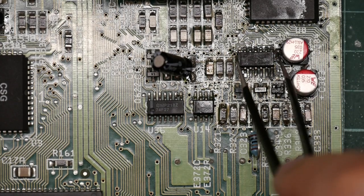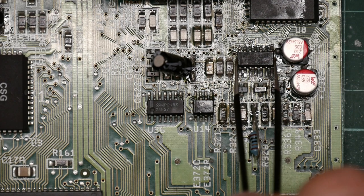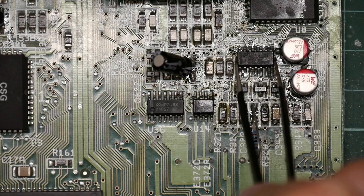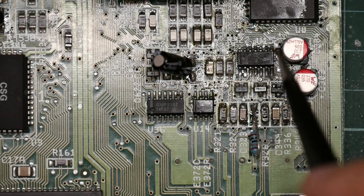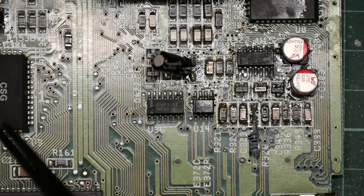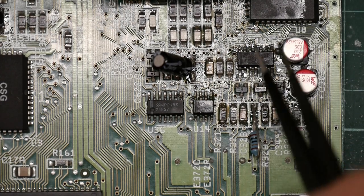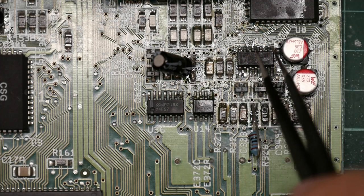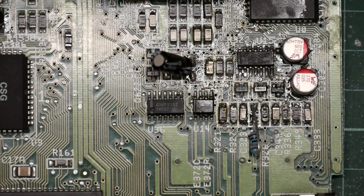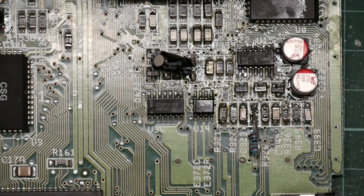So what I'm going to do is again take this op amp off the board. Then I'm going to fire the computer up, because this will disconnect nearly all the filter circuitry, and then I should get a more accurate view of what's coming out here, because I won't have the actual components of the op amp interfering with the signals in these pins. Good news is, at least I'm going to be getting a lot of practice with my surface mount stuff.